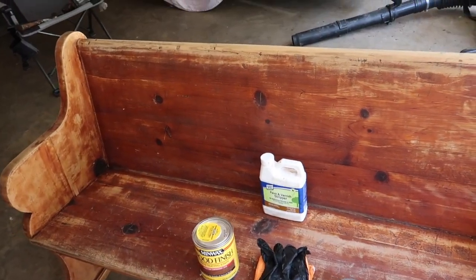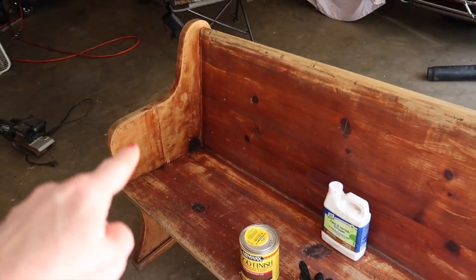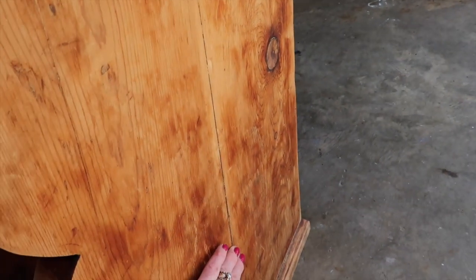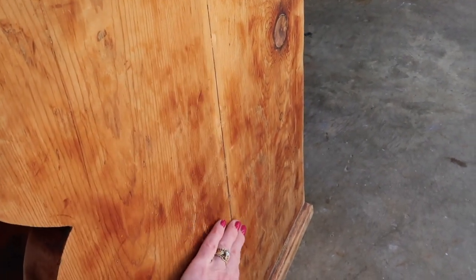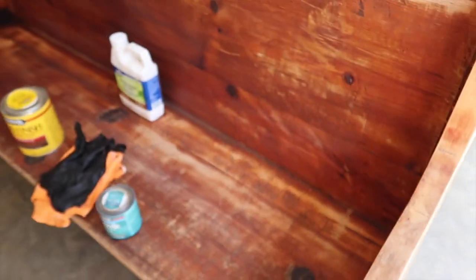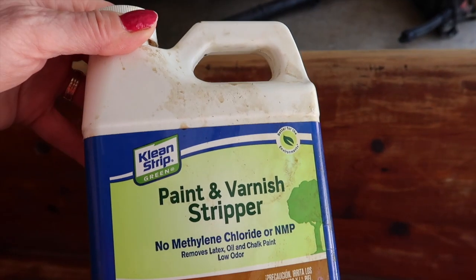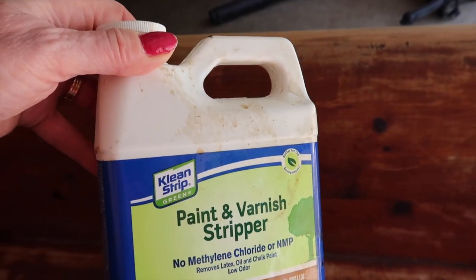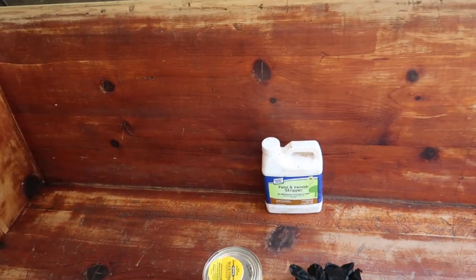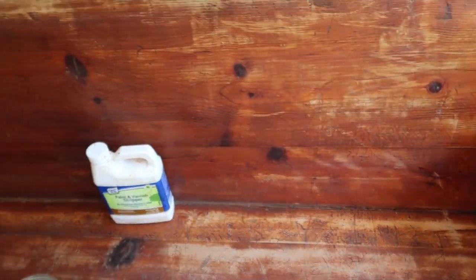It's been a couple of weeks since we worked on the pew and I'm ready to get it finished today and out of my garage. After he cut and attached that end, the undisturbed end had a big space in the wood, which is the reason we chose the other end to cut down. He filled it with wood glue, sanded it, and we applied stripper and scraped it, used an electric sander, and got off as much of the varnish and stain as we could. The clean strip paint and varnish stripper from Walmart was honestly a waste of $10 — it's supposed to be no odor and fewer chemicals, but it didn't really penetrate the varnish at all. We basically just used the electric sander.